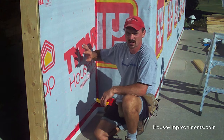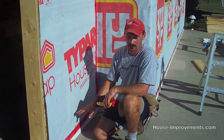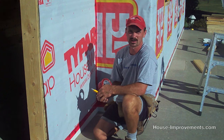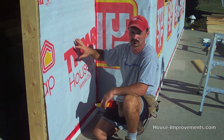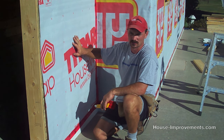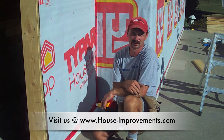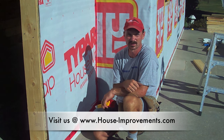So we've showed you how to install the house wrap. We've showed you to overlap the seams by 12 inches, tape any seams you have, cut your windows and doors open. There isn't much more to it — it's a pretty simple job, but it's very important. This keeps the moisture that gets through your exterior finish from getting into the interior of your house, so this is a very important step. Thanks for watching today. You've seen this video probably on our YouTube channel, and you can check our other ones out there as well, or you can go to our website at houseimprovements.com. Thanks.